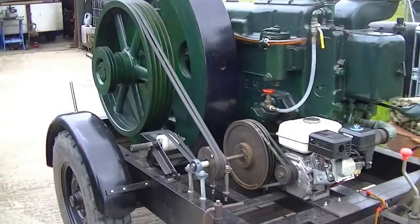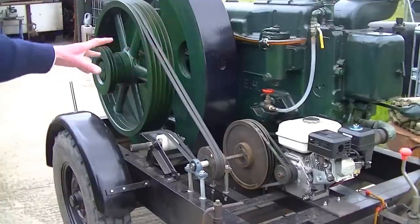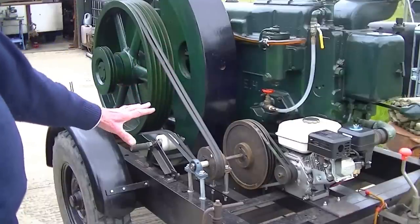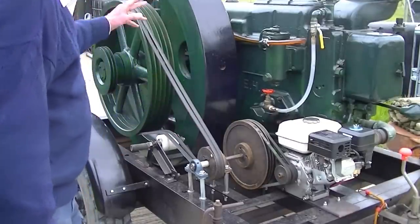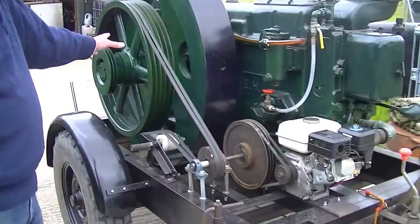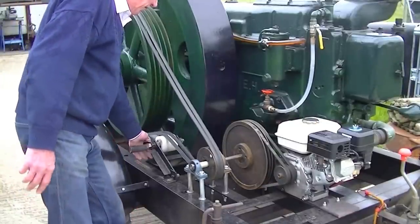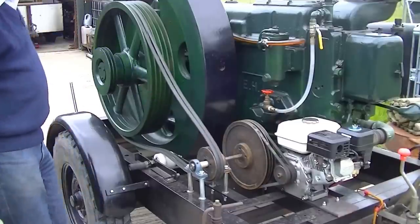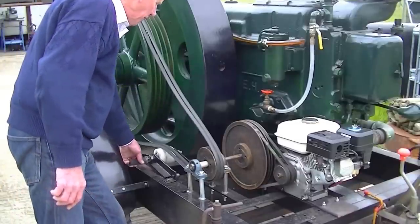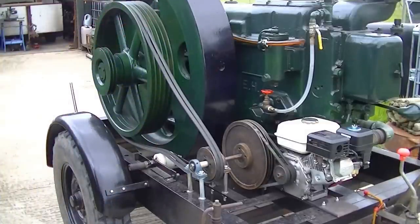Because health and safety wouldn't allow me to use compressed air on a rally field, I had to think of a different way of starting it, and this is it. There's a donkey engine here which is about 4 horsepower, driven through a series of belts to reduce the speed, and then from here it turns the flywheel. There's a sprag clutch in here, so when the engine starts, the flywheel will go faster than this engine and it freewheels like a bicycle. This is my patented clutch — all it does is tension the belt. When you want to start the motor, you pull this up gradually, it gets up to speed, and then you switch the fuel on the other side.